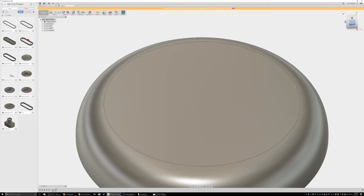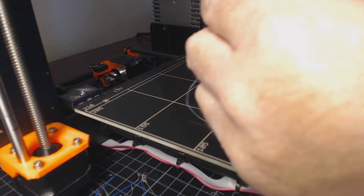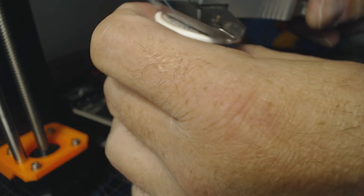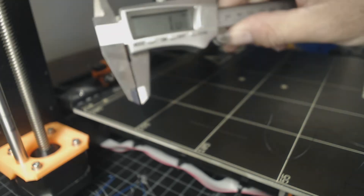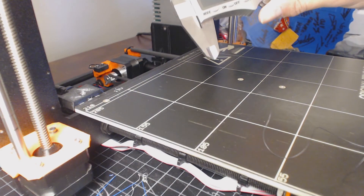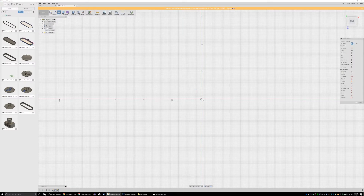Next thing I've got to create the holes. I zero the calipers and I want an idea for minimum — that's 0.85. The top of the head was 1.32, so I'm going to say a two millimeter hole. That'll give me some clearance. Go a rectangle — is that too much, is that too far apart? Those are the center points of each hole. Here we go, six by six.